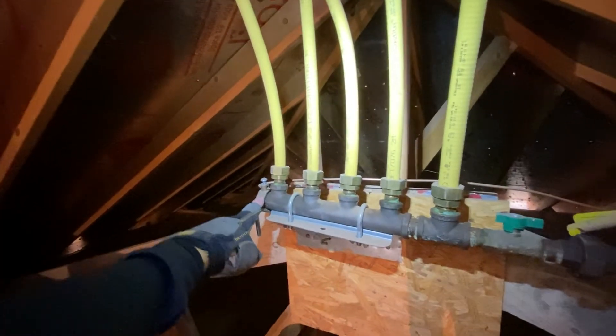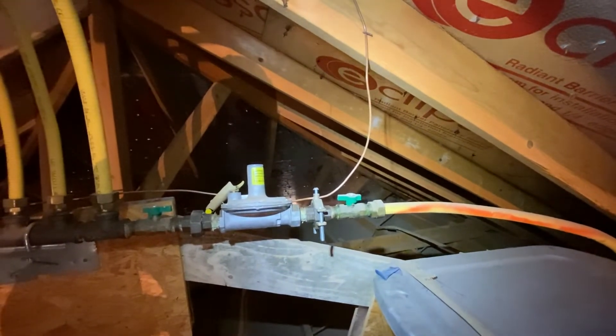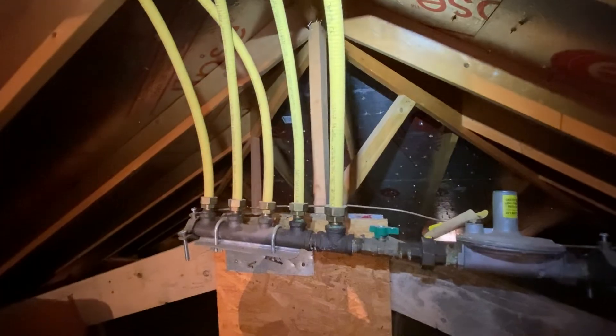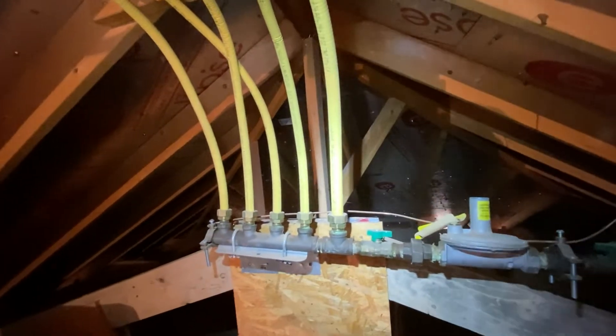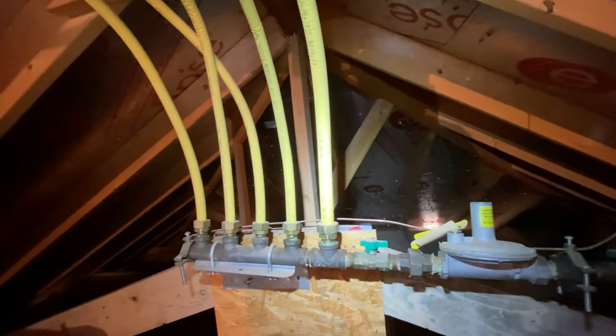That's good. It establishes an electrical connection between both sides of the regulator, meaning that everything on both sides is properly bonded and grounded as it should be. That's important because I don't want anyone's house to blow up. It's also why I recommend that an electrician evaluate any CSST to make sure that it is properly bonded and grounded.